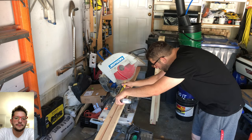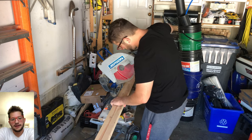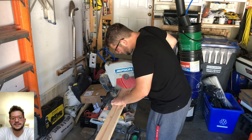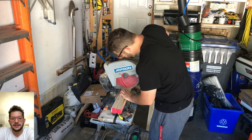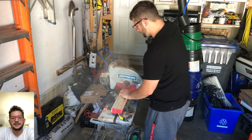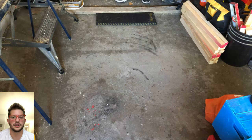Here we're marking out the tops and bottoms of the panel frame. This is at 27 and a quarter inches, and my mark is at 27 and a quarter but I align my saw blade to the right of my pencil mark. That allows me the perfect fit for the acoustic insulation — the perfect internal dimensions of the frame to nicely hold the acoustic insulation inside. We're going to get all of these lengths cut at 27 and a quarter and I'll have all of the cut sheet and details in the description of the video.